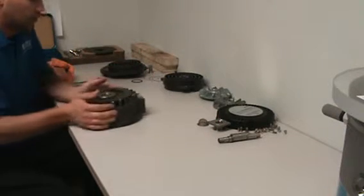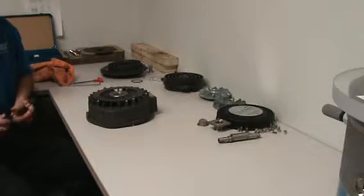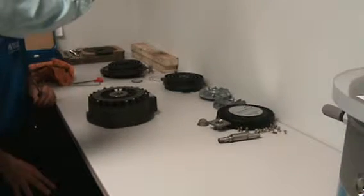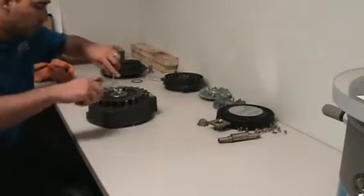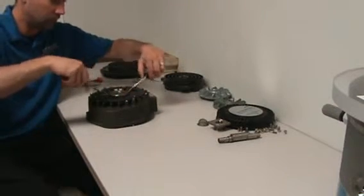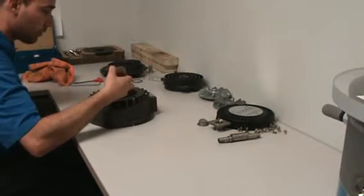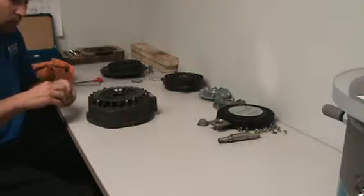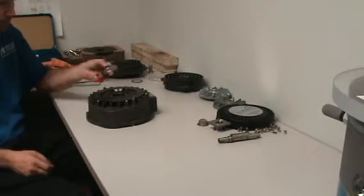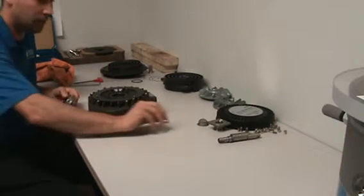Take three screws out, and two flat heads should pull the bearing housing up. Critical point on the ISP 250: the washer between them. Does it matter which way it faces? No, orientation doesn't matter. It comes in the major kit.